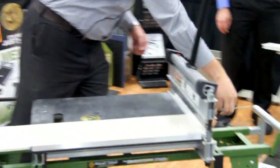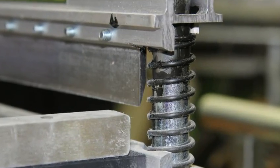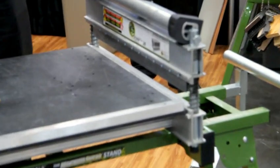So you've just got a knife in that shear — the knife's coming down when you pull that handle. Exactly. It's a very sharp blade. It's flat on the inside and it's beveled on the back side, so you always get that nice, sharp, clean edge.